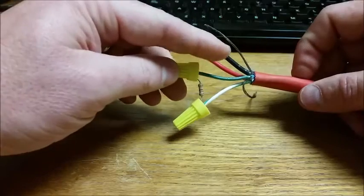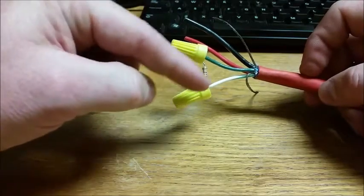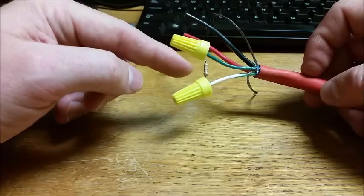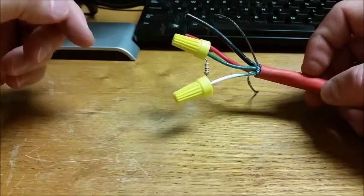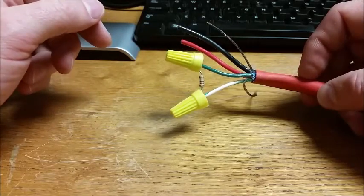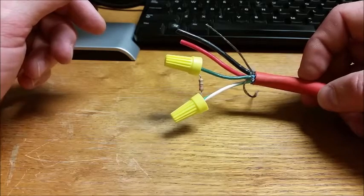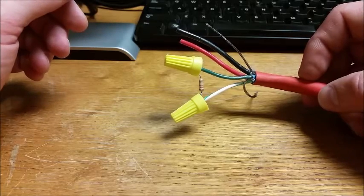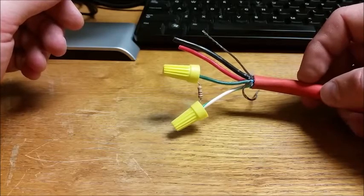And if we read with an ohm meter on the other end of this cable through the resistor and back again, we will read the 120 ohm resistor plus the resistance of these two conductors for whatever length they are. Our CO systems and tracking systems is typically 1,000 feet sections, so that's usually where you can narrow it down to using this technique and isolate your power and communications.